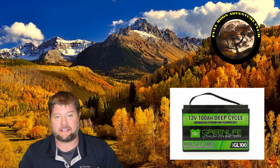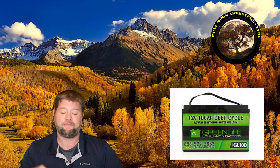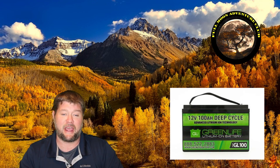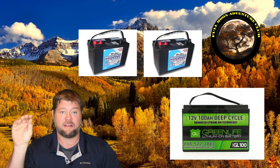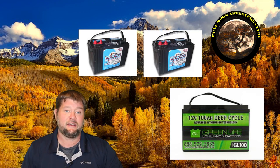The reason for that is these lithium batteries have a battery management system that keeps them from being over-discharged and overcharged. It's a little computer inside that says hey that's enough, cut it off — and they stop at about 10 percent of their overall capacity. That increases the longevity of the batteries and also prevents any danger from going all the way down to zero, which can damage the cells. So that's a safety feature, but we did get to use all 180 amp hours of that power — 90 percent — as opposed to a lead acid or AGM battery bank where you'd only be able to use 50 percent. So if you had two lead acid batteries each with 100 amp hours for 200 amp hours total, you could only get about 100 amp hours out to 50 percent, then you'd have to recharge. With these you can take them all the way down and recharge.